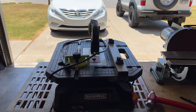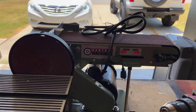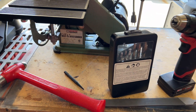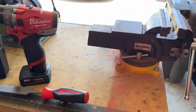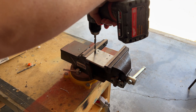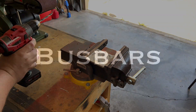For this project I decided to make my own bus bars because they're not widely available for these SPIM cells. You're gonna need a few things: some kind of bandsaw, a benchtop grinder or sander, a hammer and a punch, a drill and drill bits, a file, and most importantly a vise. A vise is very useful for holding pieces when you're manipulating them and drilling holes. If you're not making your own bus bars, you can skip this step.